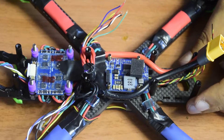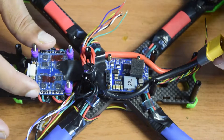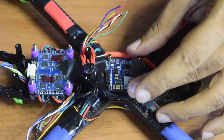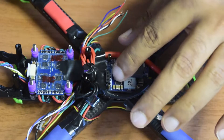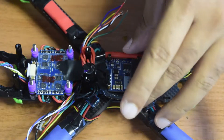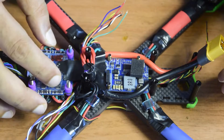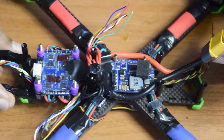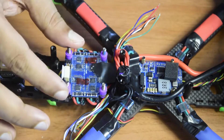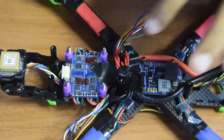Before we start the installation, let me walk you through my plan on how I'm going to place the video transmitter. My flight controller for this drone is the Matek F765 WSE. It already comes as a stack with its power distribution board, so I did not have space on top due to height restrictions. I'm placing all my stack on the back side of the drone frame where I've installed the MCU, and I can very conveniently place the video transmitter on top of that motor control unit.